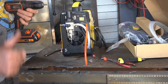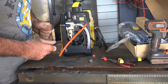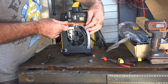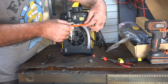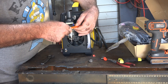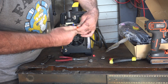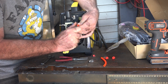I love it when I start assembling a new machine - there's nothing more fun than getting it to the point where you can actually cut with it. Have a look here, this fitting actually moves independently to the nut underneath it, which is ideal so we can take the shortest distance possible so the hoses don't get tangled up. With this hose here guys, measure twice and cut once - I have done it before where I've cut it too short and that just ruins your day. I'll trim up the end of it because it's a bit ugly - I cut it with long-nose pliers, which probably isn't the best tool.